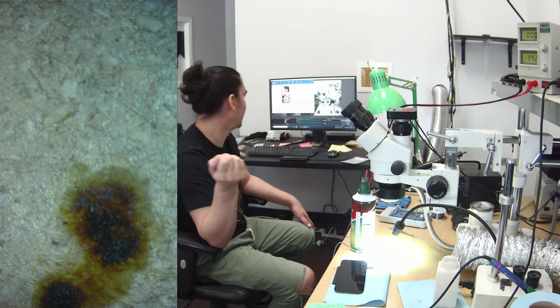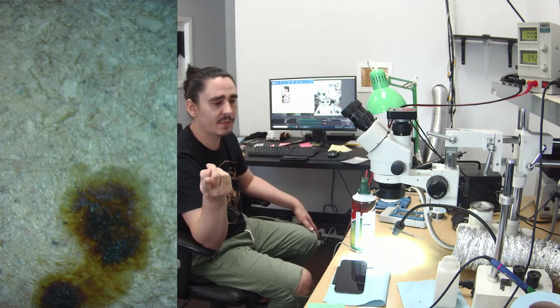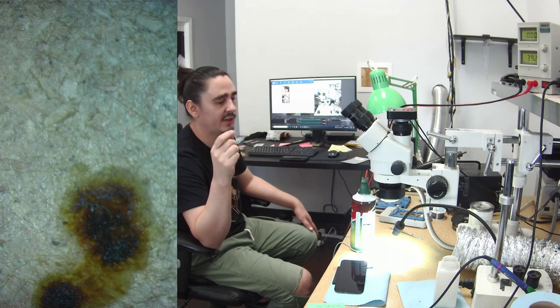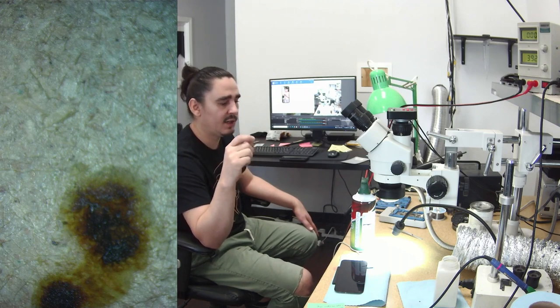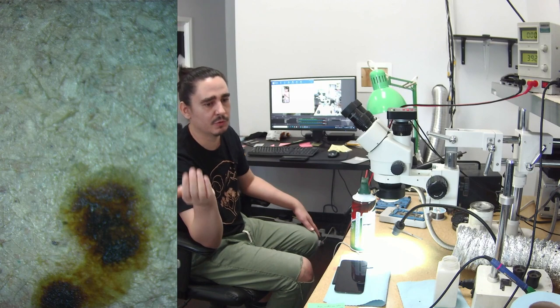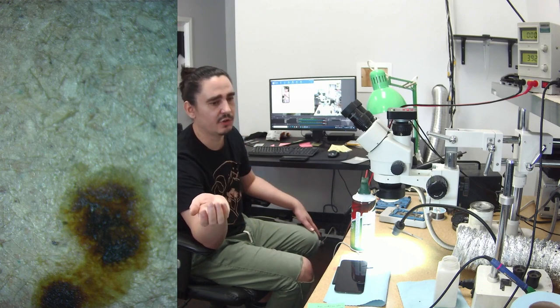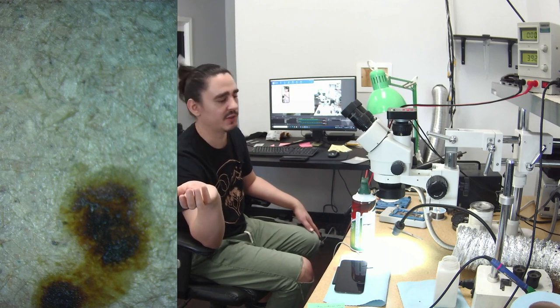Interestingly enough, however, if that coil is missing, but the boost chip itself is not on the board at all, and you've just bridged boost to main, then I don't think that coil is actually needed. It will still boot normally. However, when the boost IC is on there, then it does need the coil. I'm not 100% sure on that, but I'm pretty sure that's how it worked.